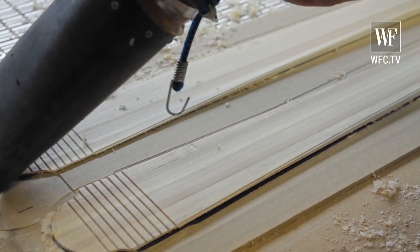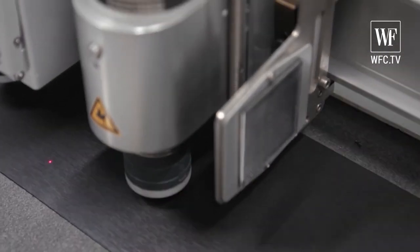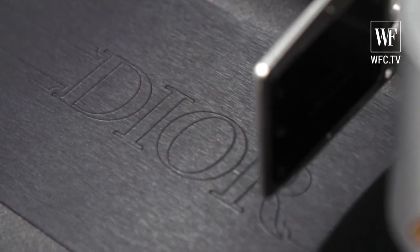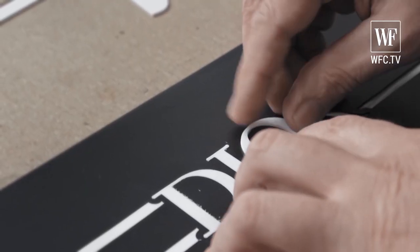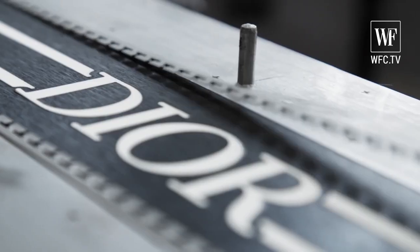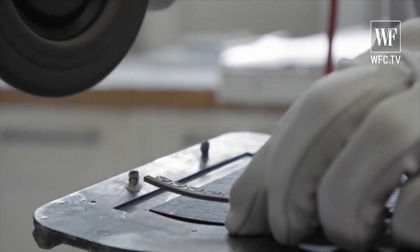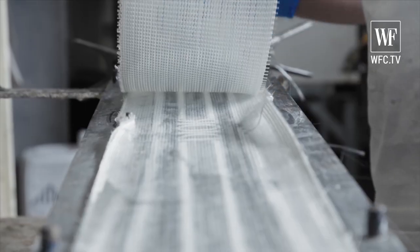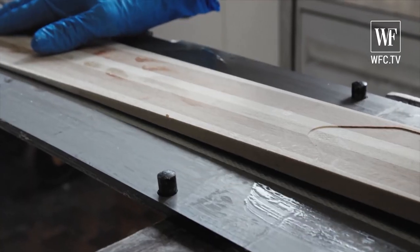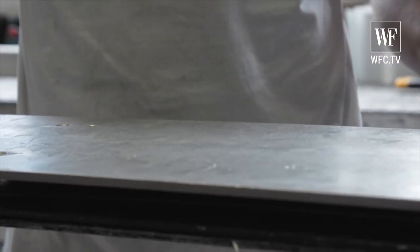We use a lot of wood, you have the racing base, thick steel edges, and a rubber insert which makes the ski very smooth to ski with. The construction we use is called a sandwich construction. The base, the fiber, the glue, the sidewalls are put into the mold and it gets pressed in an oven for about 20 minutes.